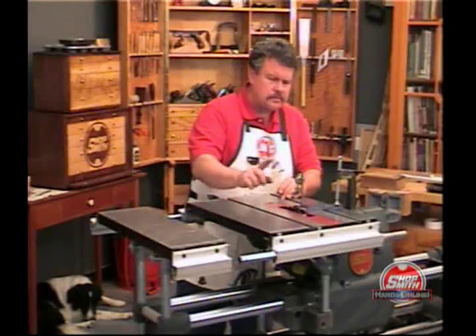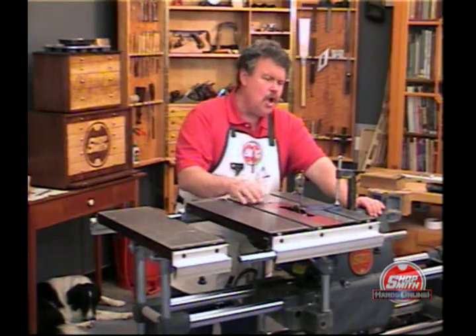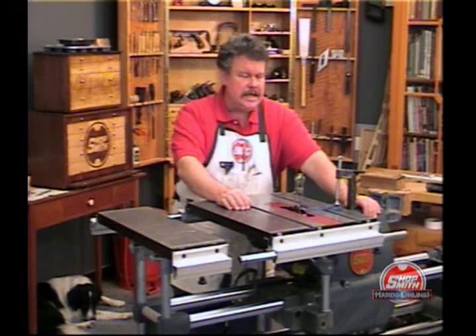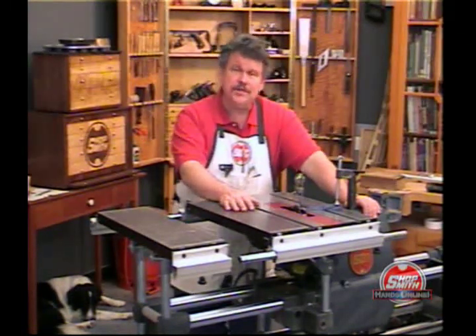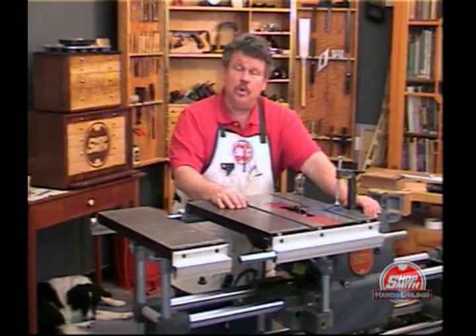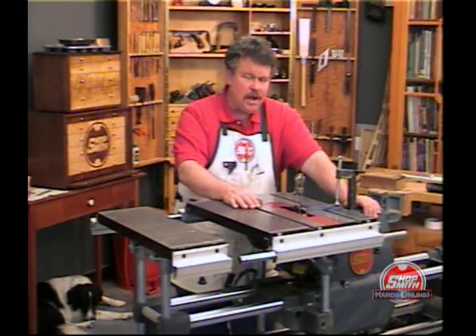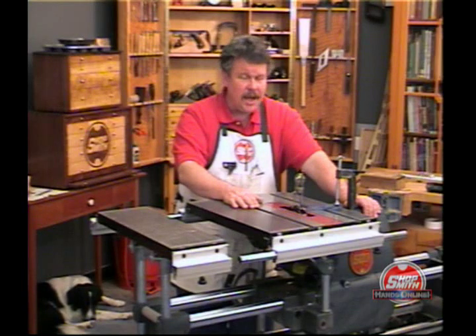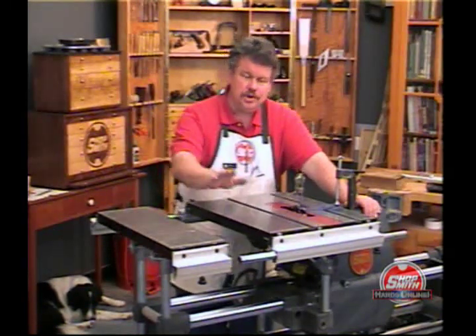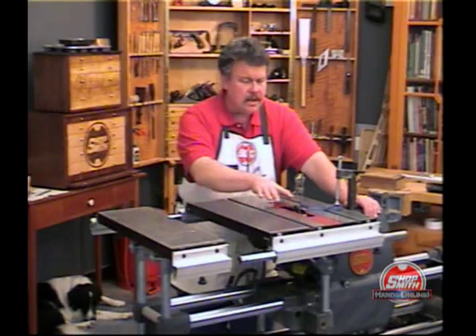To show you how rigid this is, I've set this up with a little measuring tool. Those of you who are machinists will recognize this right away — this is an old Starrett dial indicator with the pieces and parts you need to measure run-out. It was often used when drilling large diameter holes to ensure they were absolutely concentric. It's set up here to measure the twist in this table and how closely the table remains aligned with the dado blade set up right here.